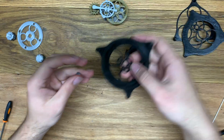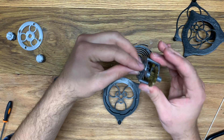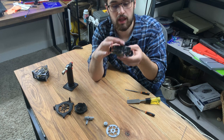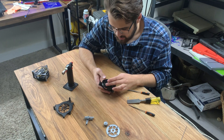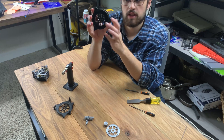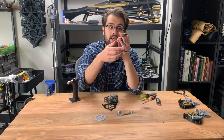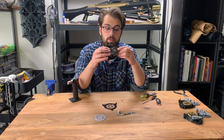Just file out the inside there and get this piece fitted. Then attach the larger of the two hexagons to the escapement. Now pop the escapement into the frame by having the hairspring go underneath the gear frame, and that bottom pin we just put on goes through the hole in the ratchet case. Then put in the winding spring, line up the two hexagons, click them together — it should be holding itself together, though it's just not very stable. That's why there's a top frame piece with a center pin to help keep the tourbillon in line.